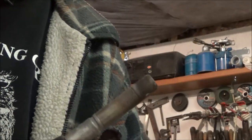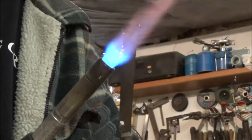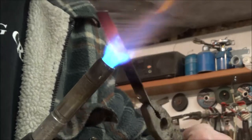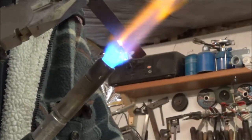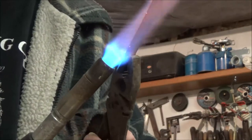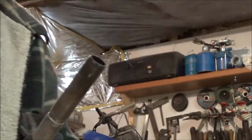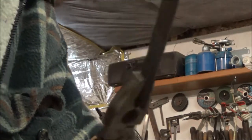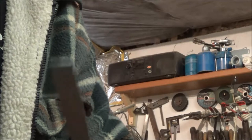What I'm going to do now is normalize this. All I want to do is get it up to a red heat and then just let it cool naturally. That should have normalized it and it should be soft again. I'll have to wait a minute.